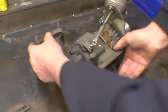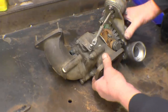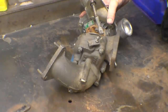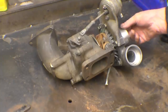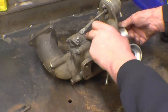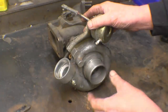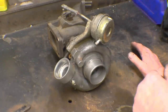In the back end there's a fan called a turbine. Exhaust gas from the car engine goes into there, spins the turbine, and comes out and goes down the exhaust pipe into the atmosphere. These two fans - the compressor and the turbine - are connected on one common shaft. Driven by the exhaust gas, that spins, air goes in, the air is compressed and blown out. That's basically how a turbocharger works.